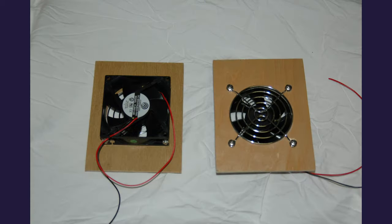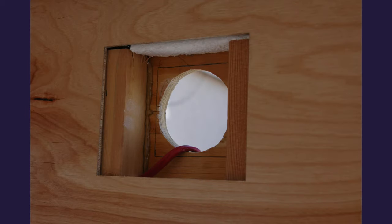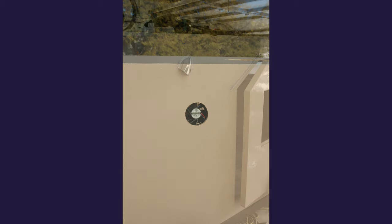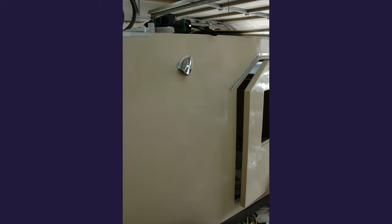I live in the desert southwest and I wanted to add some ventilation to the trailer. So I grabbed a couple small computer fans, installed them on a piece of interior plywood, and attached it to the trailer wall. I had a switch up in the roof so I could turn them on and off. I calculated that this would turn over all of the air about every three to four minutes. Although it works reasonably well, I don't think I would do it again. A fantastic fan on the roof, I think, is a much better alternative — but I have it and it's okay.